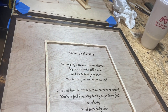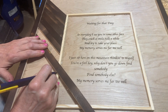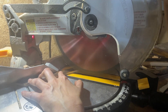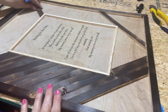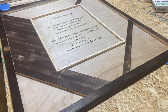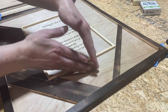The interior and exterior frames are done. This step took quite a lot of time since there are many small pieces, each requiring two angle cuts. We initially used the miter saw but moved to a small hand saw as the pieces got smaller — sometimes that's the best approach even compared to a power tool. We got to the end of one side and placed a piece in the opposite direction to keep us on track for the herringbone pattern. The sides will be chevron-looking, then as we move inward the pieces stack up against each other.